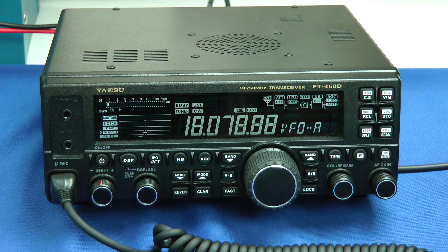For more information on the original Yaesu FT450, check out our product review in the December 2007 QST. Now, a little recap: what's new about the Yaesu FT450D? It has the automatic antenna tuner built in, a new knob design, illuminated indicators, and it comes with the 500 and 300 hertz roofing filters that weren't available previously.